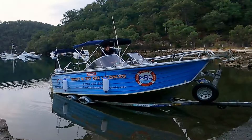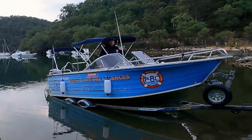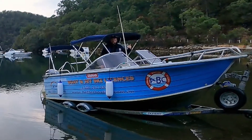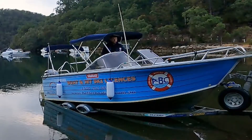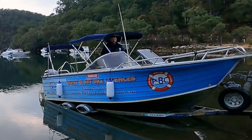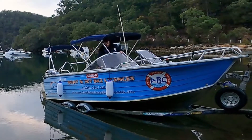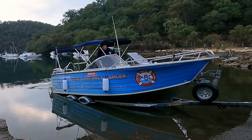If we do need to turn the navigation lights on, we've got them ready. What I'm going to do now for my boat catch is drive the boat forward a little bit, take the load off the boat catch, release the boat catch handle, then let the boat slide off the trailer. It may need a little bit of reverse — we'll see, depending on how deep we've got the boat in and how well it's decided to stick itself to the skids. Now the boat's been running for about 30 seconds.